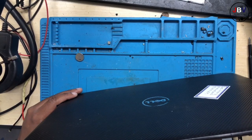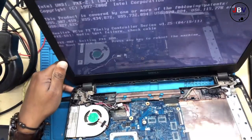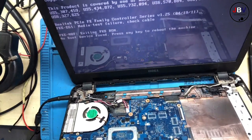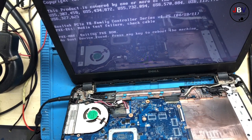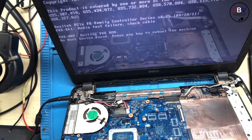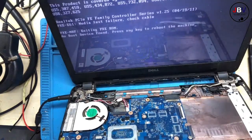All right, guys, I'm done. Anyway, I left yesterday and I came back today. And there we are, the machine is turning on. The issue here was the RAM chip. That bent chip, I removed it, remember? Because it was shorted, it was causing a short for the second time on the 19 volts. I installed another chip. The chip I was using first was faulty, so I used another chip. And there we go.